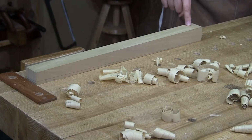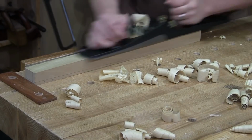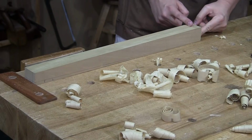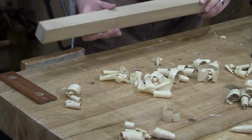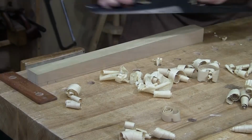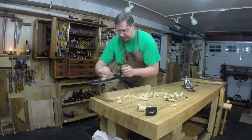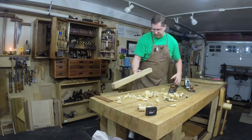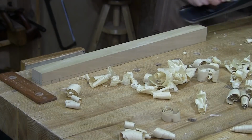That will actually prevent the blade from cutting because it's tilted down and lifted the blade out of the cut until it intersects. And with every pass you take, you're drawing this unplaned line back just a little bit further until you bring the whole thing into the same geometric plane. That felt pretty good. Maybe one more pass and I ought to nail my line.